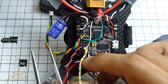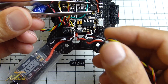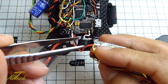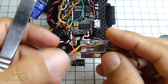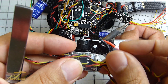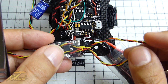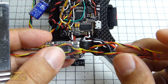The other thing I've wired in here — let me try and bring this into view if I get these cables out the way — is off one of the ESC wires I've got the main rail voltage coming to this chroma control unit, which will be well within tolerance in terms of power input voltage. I've wired that up so that all four of these data connections are going off the exact same solder pad, so each one of these four ESC arms will all behave the same — radiating out outwards in the same pattern, which is the way I want it.